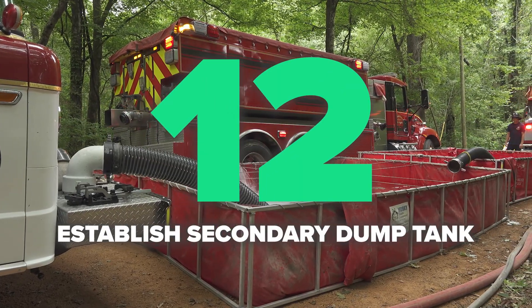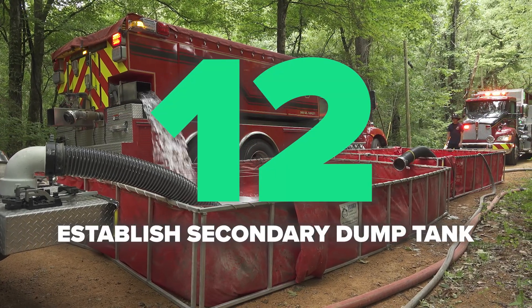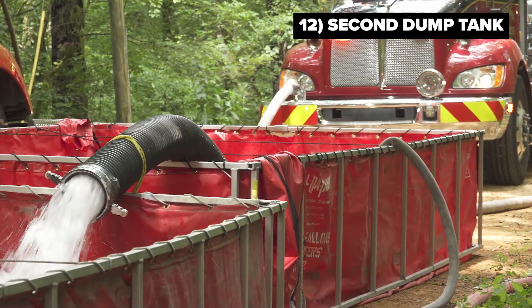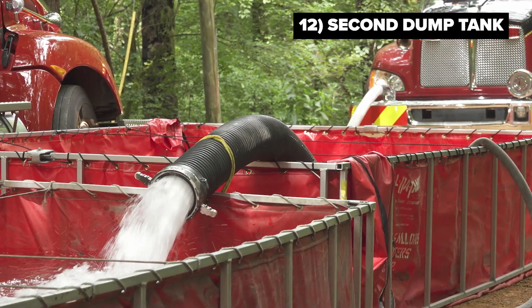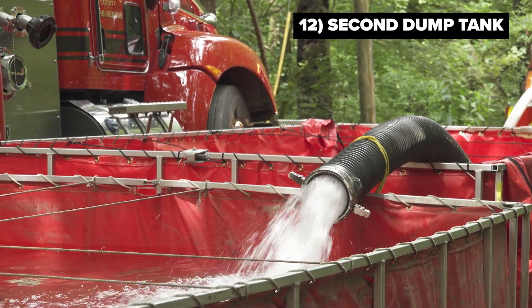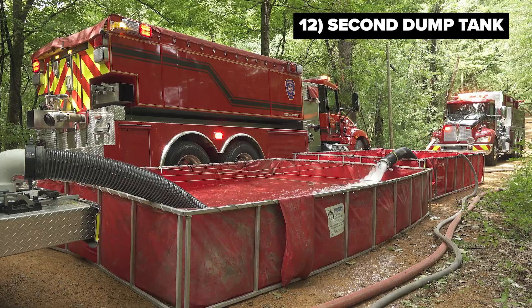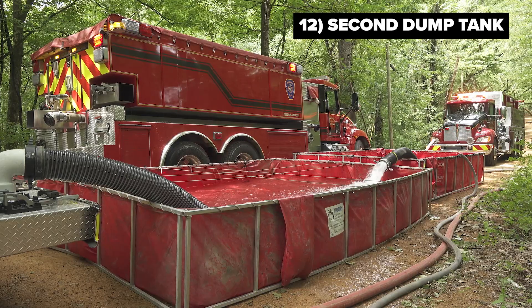At this point, as crews and personnel become available, the next stage is to put a secondary pond down. The reason we do that is to have a higher accumulation — a broader volume of water — available to us at the fire scene. The second pond will go down, and it's key now to put a drafting tube or a transfer tube from the secondary pond into the first pond.